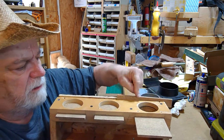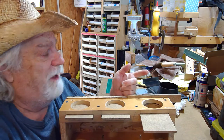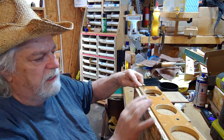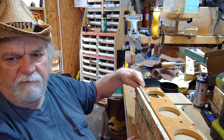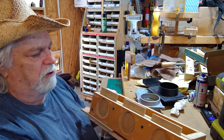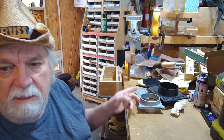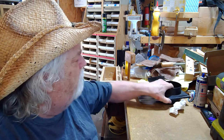This design is more than enough vacuum for the style I was using. When it closes, it goes against the bottom piece — no leaking in normal closed position. When I open it, the only air being sucked is through the hole, because that bottom piece seals off the under-side. On the aluminum gate that piece isn't there, which is why you get the air leak. You could also round off the end of the clean-out piece and pin it so you just pivot it up out of the way to clean and pivot it back. The goal is a clean-out that's also sealed so you get the best of both worlds.